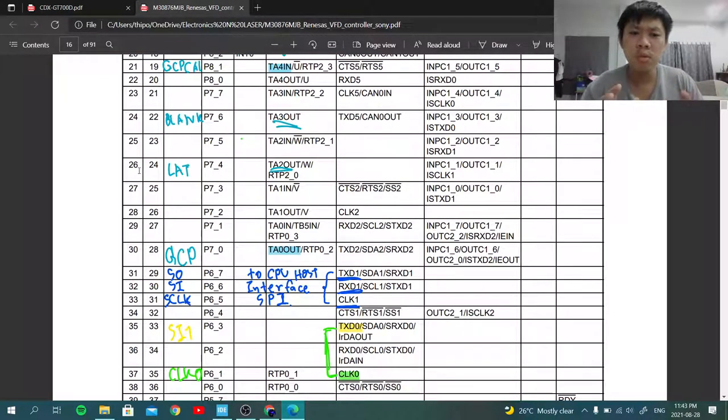So for some reason, they have separated a SPI bus, and they join the clock pin together, which is kind of weird. I never seen this before. If you're talking about multi SPI master out data interface, it would be like dual SPI or quad SPI that is mostly used with the SD card interface, micro SD card, those SDIO interfaces, and some kind of quad SPI chip.